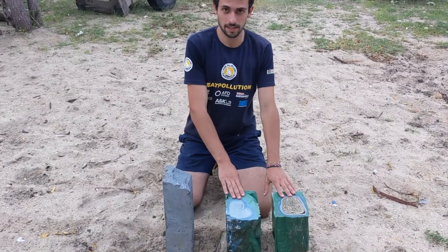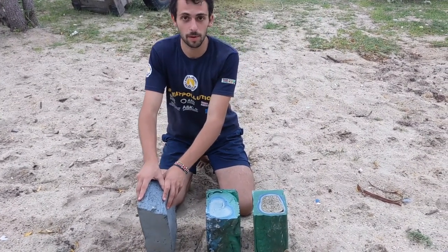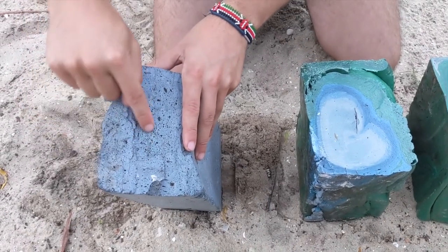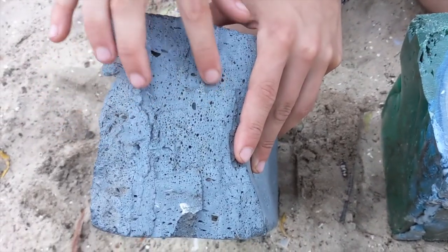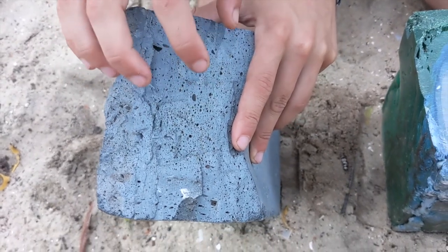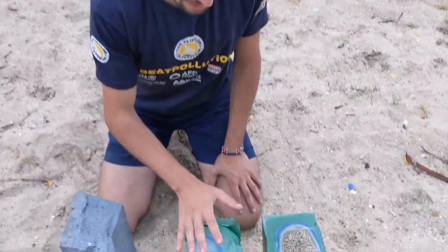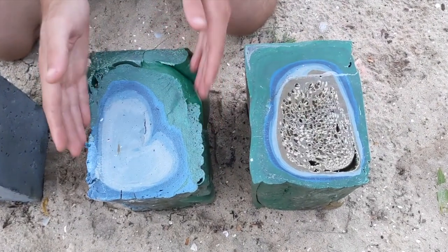Now that we've cut open our plastic beam, we can directly compare it against the process that was used for the Flipflopi prototype. And if you have a close look at the prototype, you can see that there are a lot of these voids. It's quite consistent, but there is some porosity here. And if some of this porosity was in a critical area, then we couldn't be absolutely sure that this part wouldn't fail.